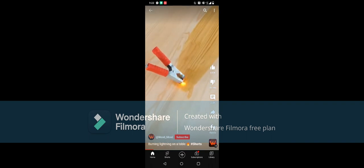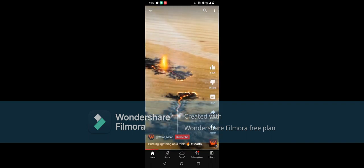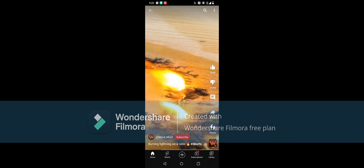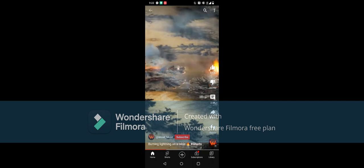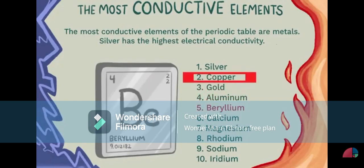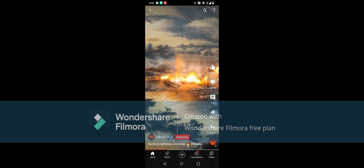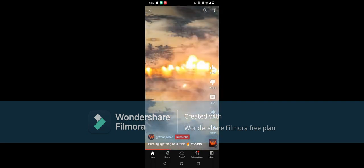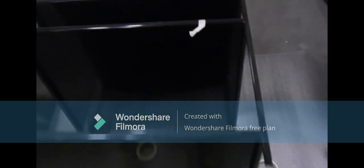Think about conductivity. A piece of wood does not carry electrical current very easily. It has a high resistance. But a copper pipe allows current through easily, a low resistance. We want a low resistance so that the charge from the powder can flow through the part. No flow means a broken chain. A broken chain means poor quality parts.